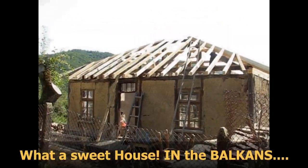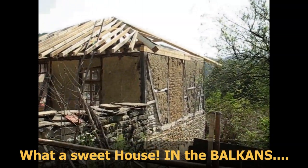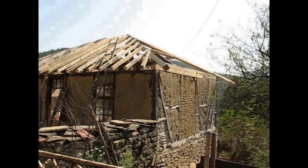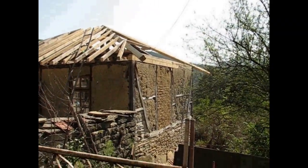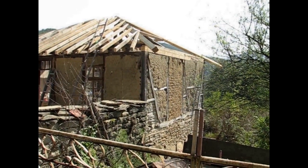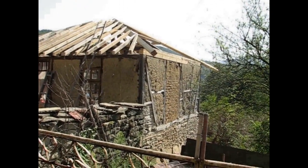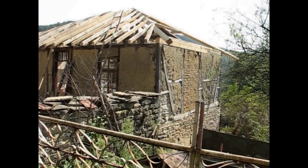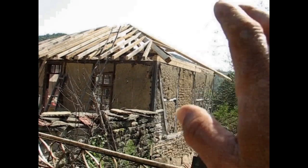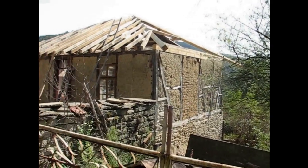And this house had a roof that almost caved in and it was leaking heavy duty, and the whole section, this was the chimney coming up over here, and that's where a lot usually starts. Leaks always start next to chimneys. That's the way it is. It's where the old slate wouldn't close up properly, and it was really hard to seal the roof around the chimney, and always the area of the chimney is where problems start, is where the leaks start, is where rot starts, is where things start falling down and caving in.